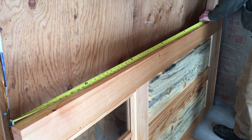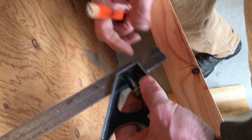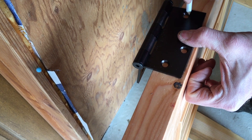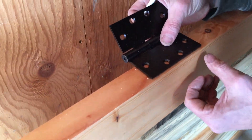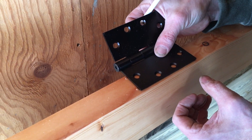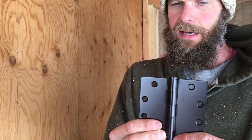I've taken careful measurements to know that the door is going to fit well. I have it built so that there's an eighth-of-an-inch gap on the left, on the right, and on the top, and a half-inch gap against the threshold. So with that in mind, I lay out the hinges on the door itself. The mortises for these hinges do not want to go all the way through to the exterior side — I've left about 3/16ths of an inch in that mortise, and that makes the hinge pop out enough to swing past any casing and the door jamb. These are four-and-a-half-inch mortise hinges — pretty heavy duty. I went big because I had already lifted these doors a couple of times and determined they're really heavy.